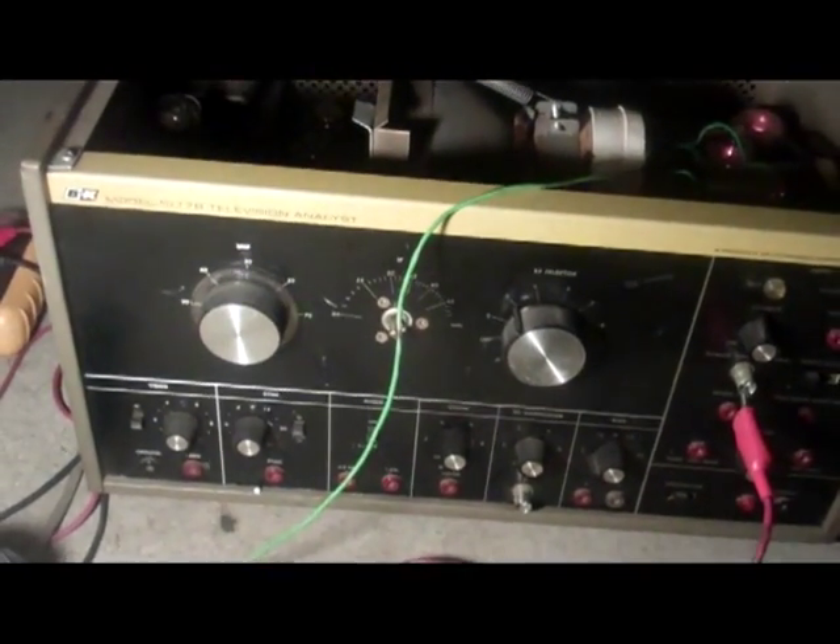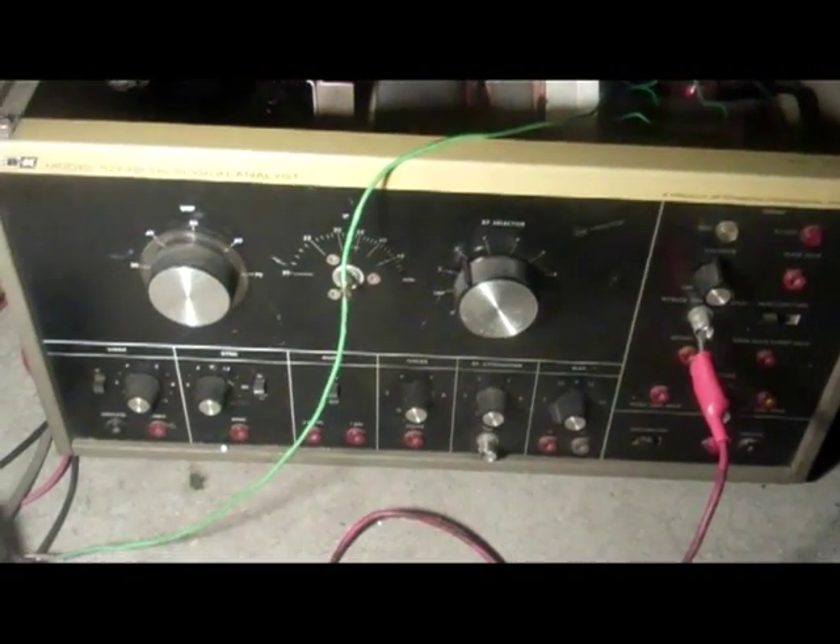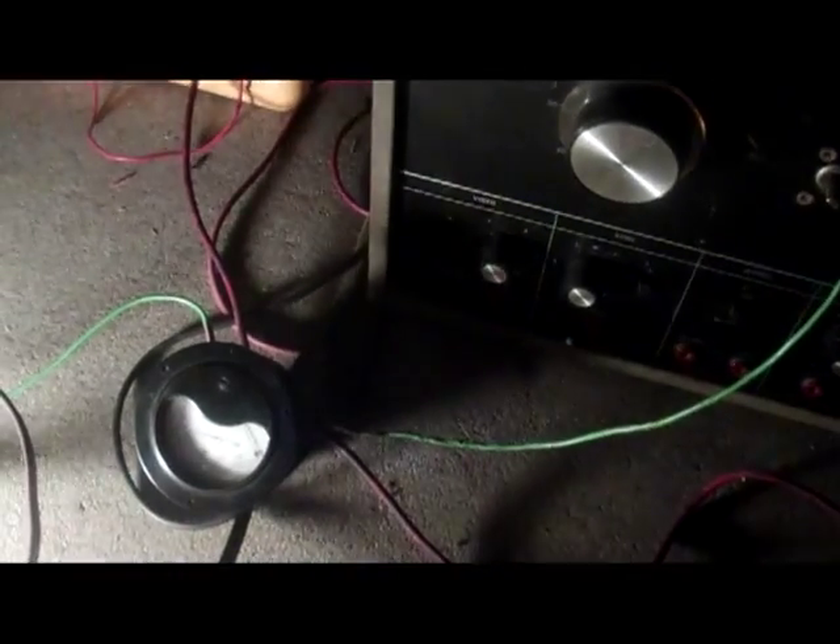Oh, this is a first for me — it appears it's the damper tube that went bad because I changed it. Maybe not. So since we're in the mode of diagnosing this Packard Bell, which I believe the flyback has failed on, I brought the television analyst up and I'm going to use the plate drive for the horizontal output, running it through my plate current meter, and I'm going to hit standby and see what happens.